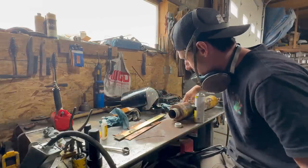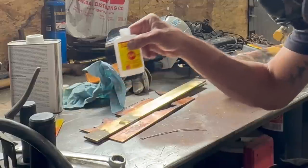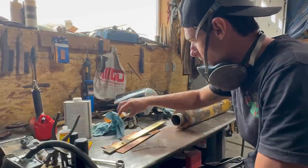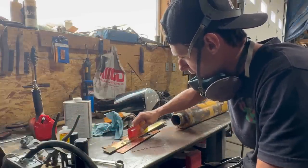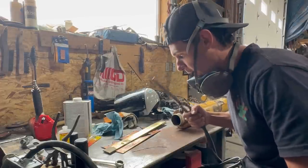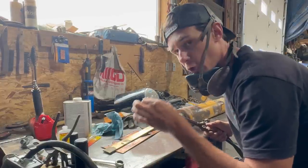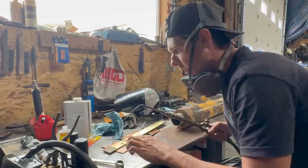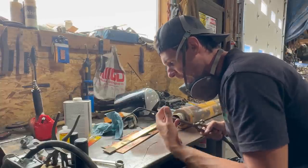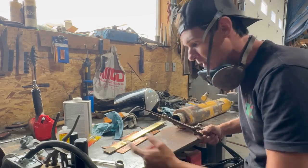I wouldn't imagine this thing is going to be under an immense amount of pressure, but we still want it to be as strong as we can get it. First thing Paul told me to do is take a little bit of liquid flux and just drop it on there, drop it into the fitment. Because this kind of wants to run everywhere, I'm just shoving it into the fitment making sure it gets in there nice. Then we're going to crack our torch, heat it up a little bit, introduce a little more flux, and start introducing our silver solder. This is a 6% silver solder — it also has tin and some other element I've never heard of. Because of all the different things in it I'm not really sure what it's going to do to my lungs, so I'm wearing a respirator today. That's why I'm pre-explaining rather than talking while I work.